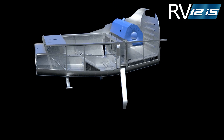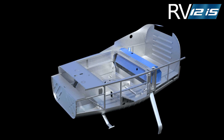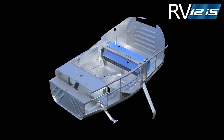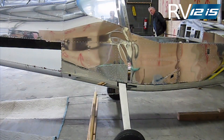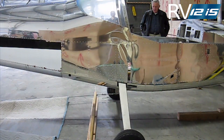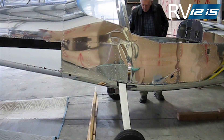In other words, the attachment bolts could withstand all of the necessary landing and taxi loads, but would fail before the surrounding support structure could deform under a high, rearward impact load. To accomplish the test, instead of having a moving fuselage and then suddenly stopping the gear legs, the fuselage would be secured and remain stationary while the gear legs were pulled rearward.